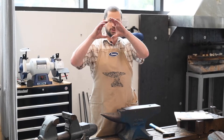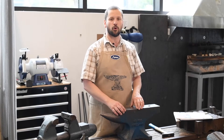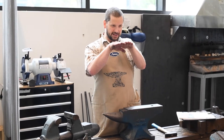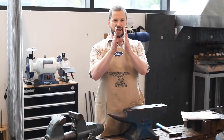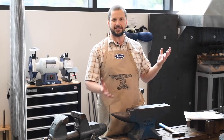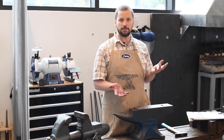This video will cover just the basics of forging copper. We'll be covering tapering — which is taking the cross section and making it skinnier and skinnier, coming to a point — then spreading, which is taking the cross section and spreading it out flatter, and then also upsetting, which is taking the end and flaring it out, typically done for rivets and other kinds of cold joining.